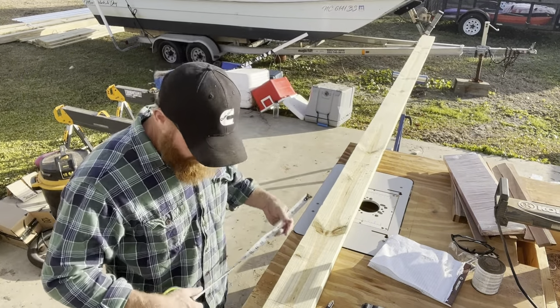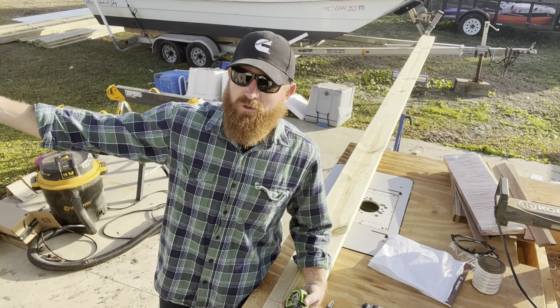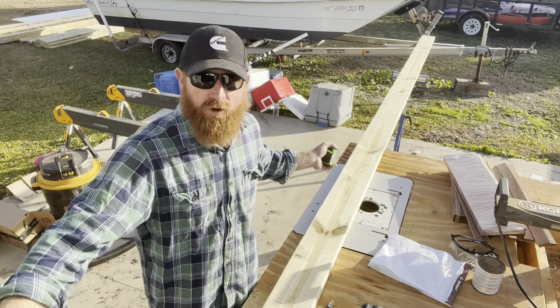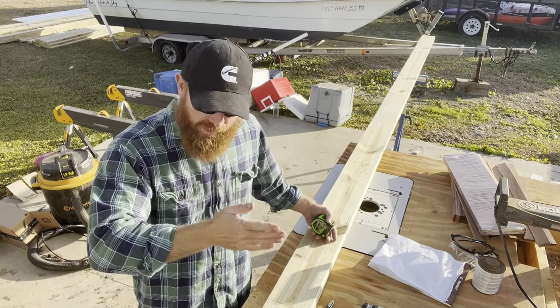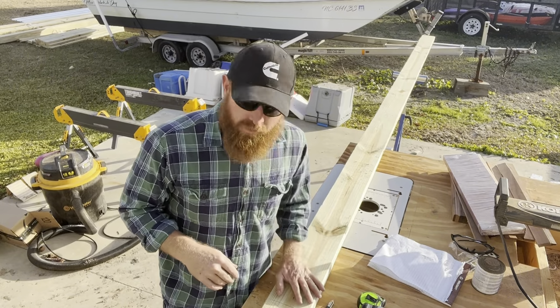Good shape. You want to make sure this is right, because you're going to mirror this on the other side where your band goes on your poles. You're going to lay it out exactly the same way from left to right. That way when you put your rafters in there, boom, everything's nice and square. All right guys, let's put this up there.